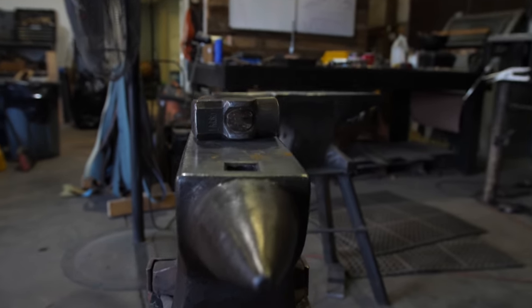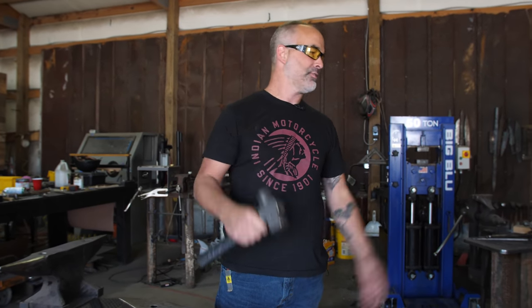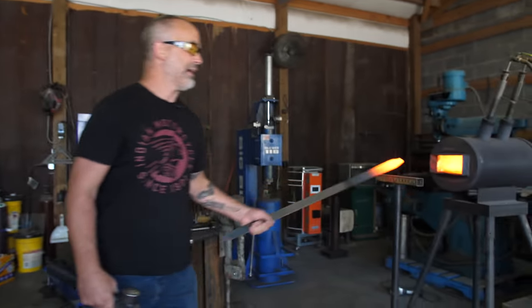It's a bit too cold, let's get a heat again. What I like to do is try to use one hammer sometimes when I'm doing this. I tend to like bigger hammers. This is about a pound and a half heavier hammer than my other one, and that's why I didn't get it done in one heat. So we're going to finish it out and make it a point.